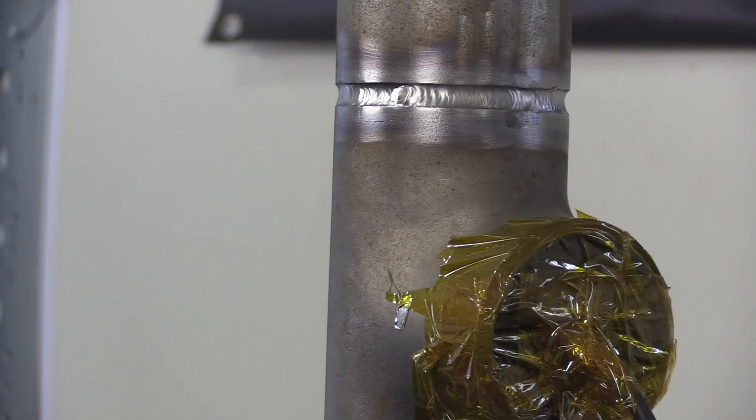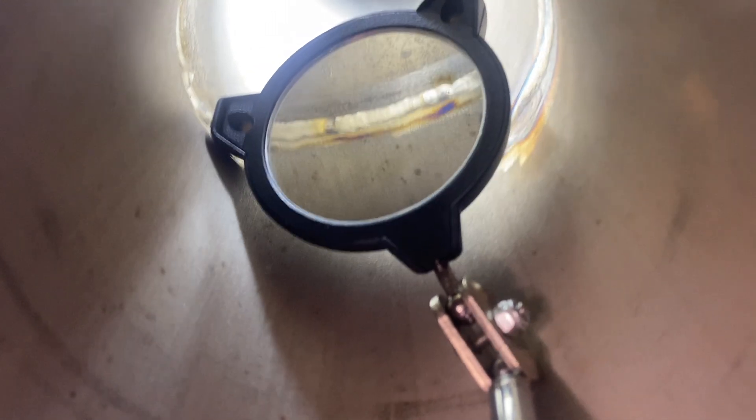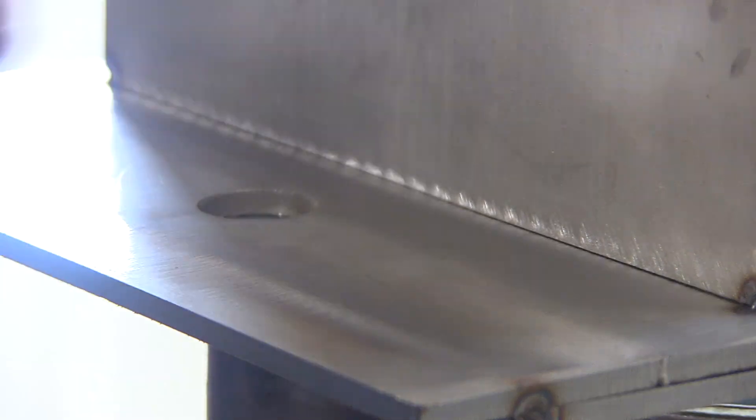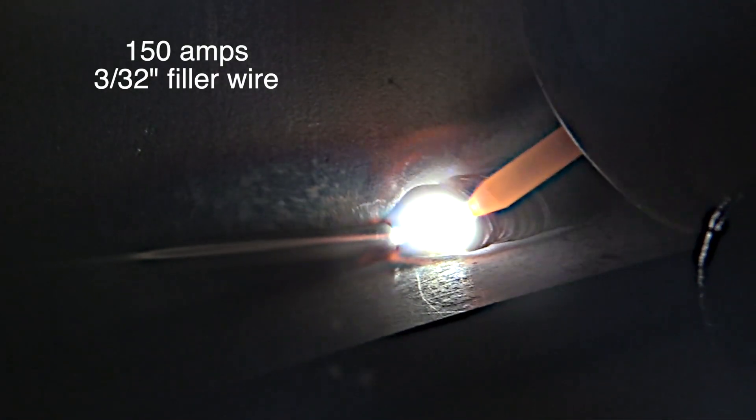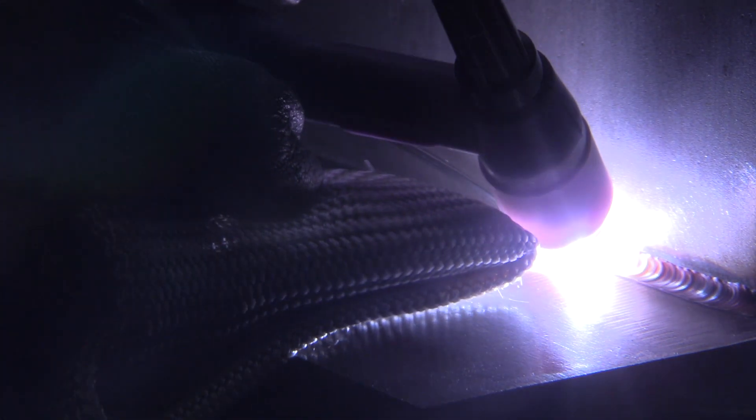You want to use a nice clean stainless steel wire brush on stainless steel. The inside of the root shows a pretty decent purge, but I probably could have used just a little bit more flow rate and let it purge a little bit longer. If you've never done any stainless pipe before, a root and hot pass on a stainless T-joint will kind of give you an idea of how it flows. This is from an earlier video - I sped it up and shortened it so there's no fluff. The first pass is at 150 amps using a 3/32 electrode and 3/32 filler metal.